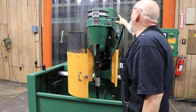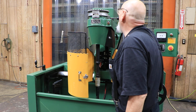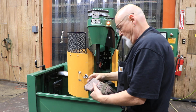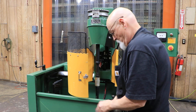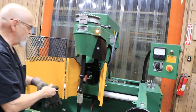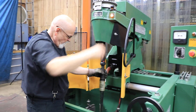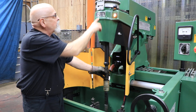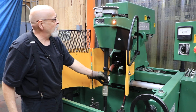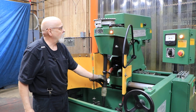The way to start this machine is up on the top — there's a little switch here, you want to push it in. You don't want to have this on zero, let's put it on five. That starts the motor running. Now when I pull this out, I'm going to put my glove on, because if you're not going to put this mandrel down into a bore, it's going to have a tendency to want to flop around. So as this is going, this is actually turning and expanding the hone each time — and we're only talking 5 tenths each time, but that is kind of quick still.